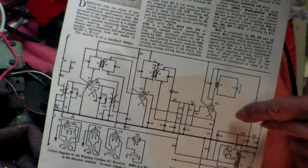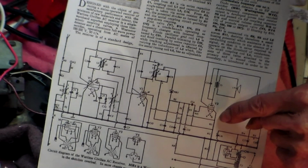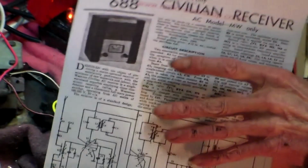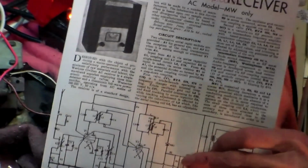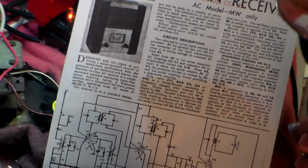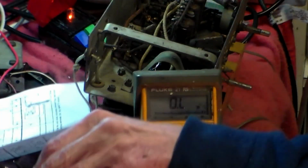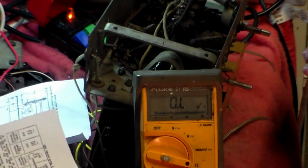Yeah, it has to be because the resistance to the cathode of the valve is 0 and they both go to deck the same, so it has to be that valve there and there. Okay, now then, therefore it goes between R9 and C13. C13, by the way, if you look at this circuit here, I can tell you straight away it's a valve 3 cathode bypass.